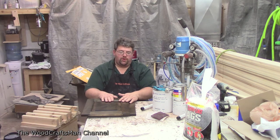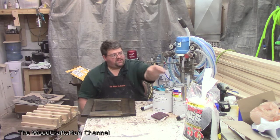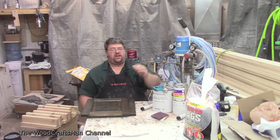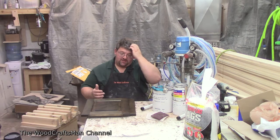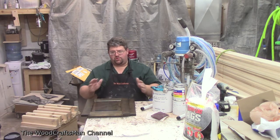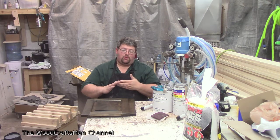I did two oak and two birch, and two doors, one oak and one birch, I actually created a pre-seal or a wash coat solution. And this wash coat solution is really nothing more than one part Hydro Plus waterborne finish and nine parts water. Now, as far as that ratio, I basically took a guess. Typically, wash coats in the solvent system go anywhere from 7:1 to 10:1, depending on what you're trying to get done. What I wanted to do here was basically raise the grain and seal the pores ever so slightly,